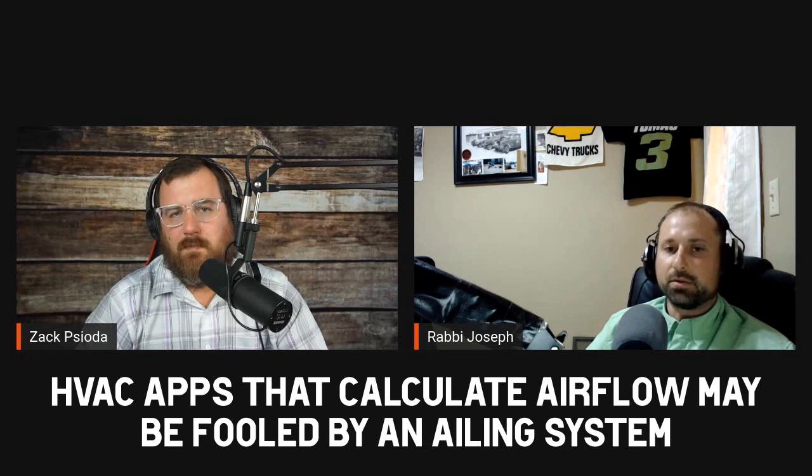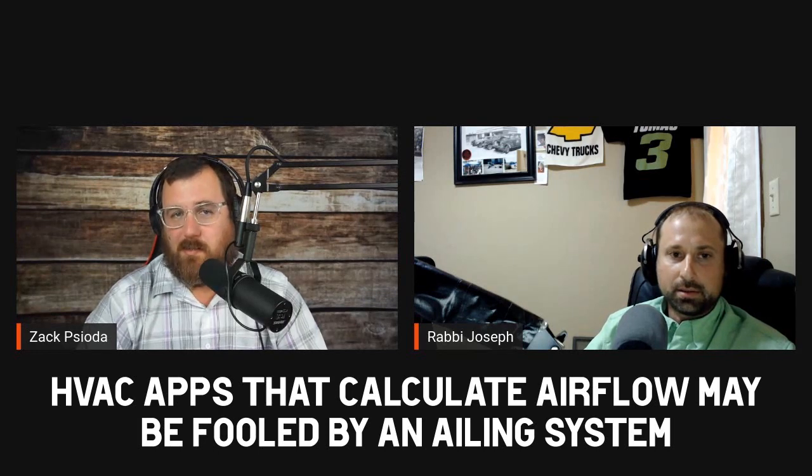The first thing I did was throw on the gauges — and the thing's not in good shape, so excessive airflow was not going to be happening. It's a package unit, so ductwork underneath the house, with returns right above the baseboards on the wall. Those kinds of units typically have lower return air temperatures anyway, because of stack effect or stratification. Supply air comes out, floats along the floor, and gets sucked right back into the return.